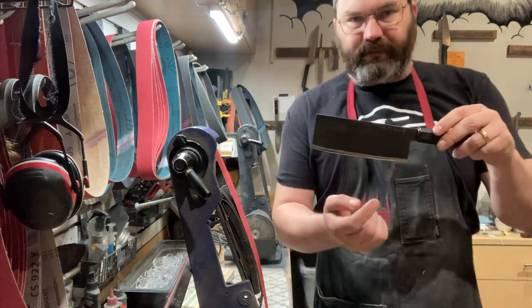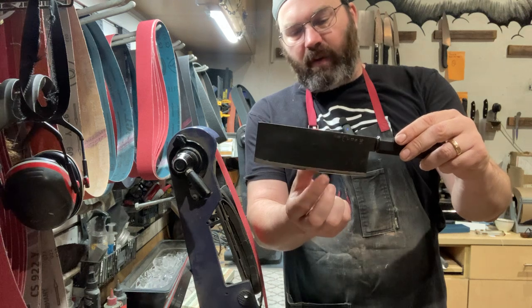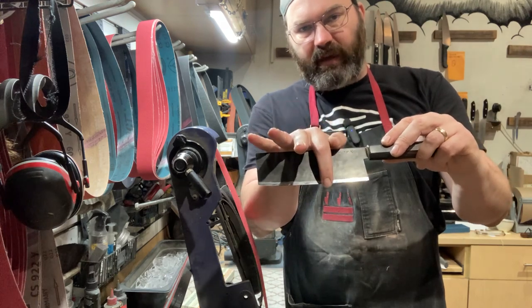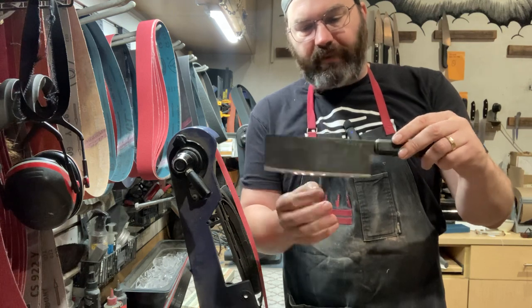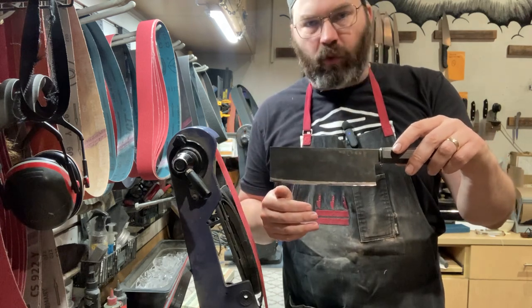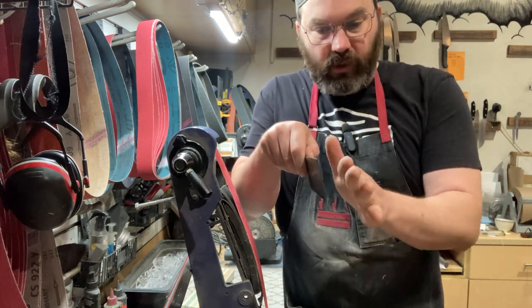Generally, scandi grind. Okay, this down here, they call scandi grind. It's one edge, okay? There's no primary and secondary bevel edge geometry. It's just from where this polished part is, the cladding and the core steel, that's the edge, okay? Now, these are also lately, it's not an S grind, it's sort of what I dub S forged, where looking at it, it starts at the spine, tapers in thin, and